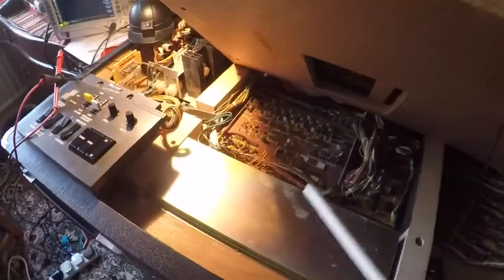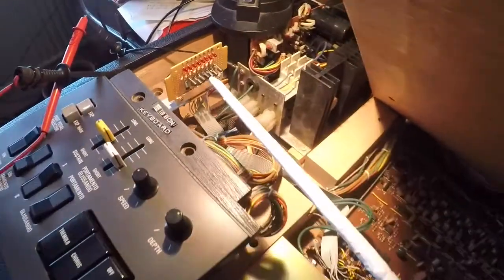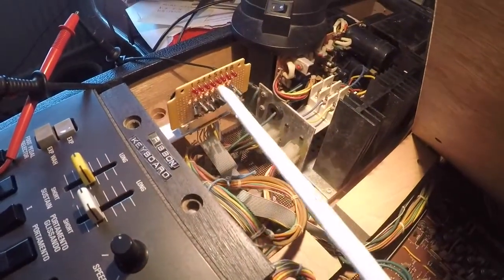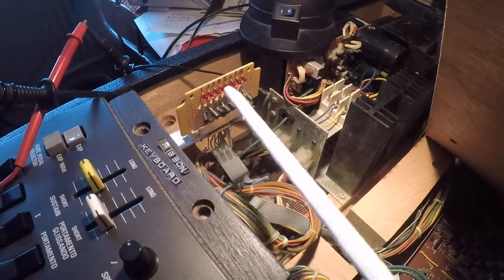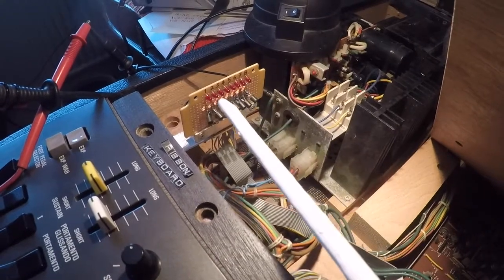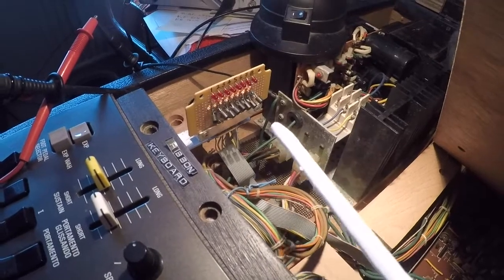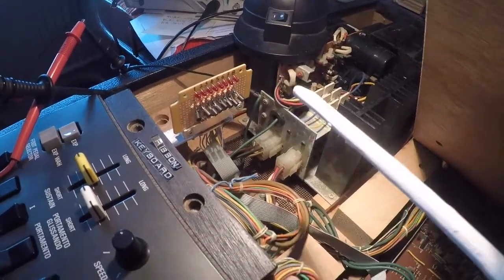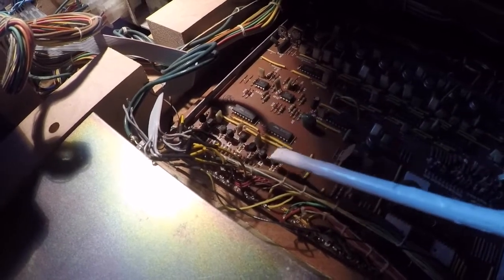This morning I built myself a little card which helps calibrate the synth — the LEDs light when you press different voices, and it's turned out to be quite useful telling me what the problem is. LED one does not light any longer, which led me to believe that the trigger section — either one of these transistors is gone or part of one of these ICs is gone.